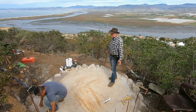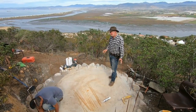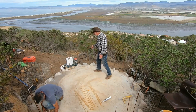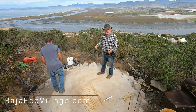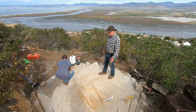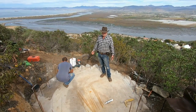In our case, we're starting with these vertical posts to connect to the old slab. Now we're going to let this sit for a day and let the cement set — even though this is quick grab, it's probably already grabbing pretty well. We're going to let it sit for a day so it's really hard, so that when we start bending the rebar above it, we're not going to break it loose if we start doing that today.